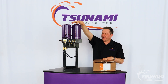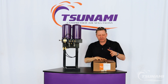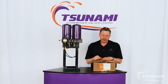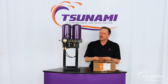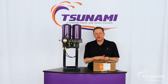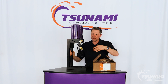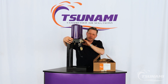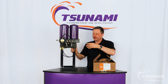Now that we've got the wall bracket on the wall and we've dropped the dryer into the bracket and it's secure, we're ready to grab the second box, which has the pre-filters and all the necessary fittings to connect those pre-filters to the dryer. All of our Pier series dryers — whether it be our new Pier 1 and Pier 3, our Pier 5, the Pier 7, all the way up to our Pier 30 — come with dual inlet and outlets. As you can see here, this upper port is our inlet port, one on each side, and the lower port is the outlet port, so you have to decide which way you want to configure your dryer.